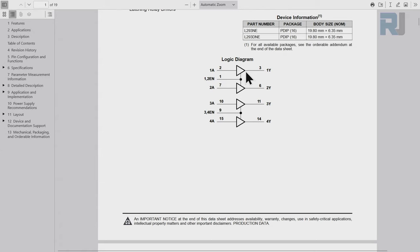Inside the loop we have two for-loops with delays. The first defines duty cycle starting at zero, and while it is less than or equal to 255 it increments, prints the value to screen, sets channel A with the duty cycle, and sets channel B to zero. This makes the motor slowly increase from 0 to 255, with a 50-millisecond delay each step.